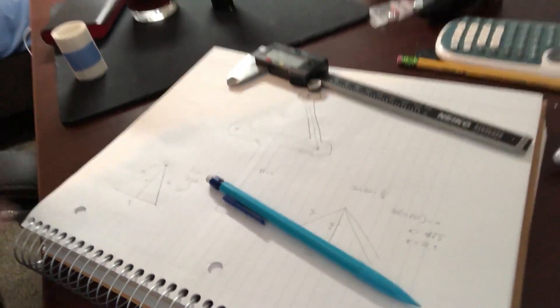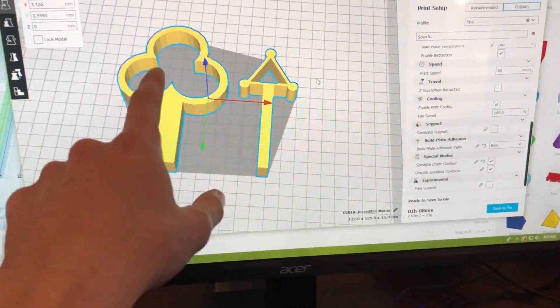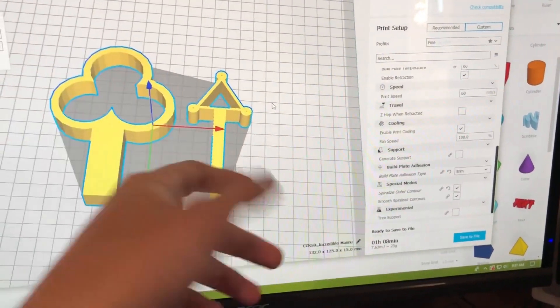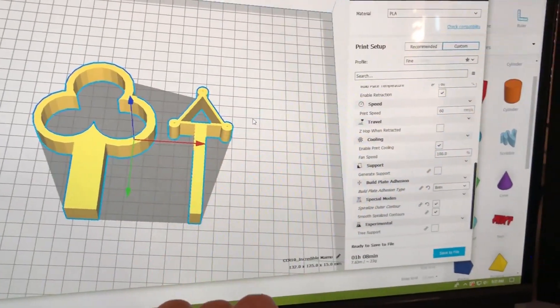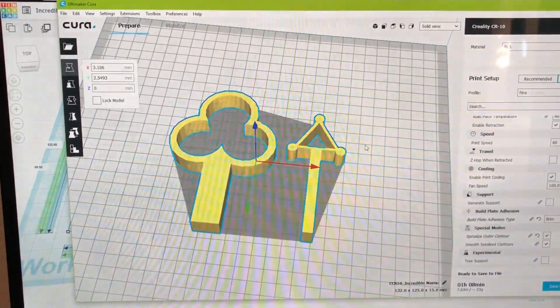I'm proud of myself for remembering my trig, and I actually checked it with paper — plotting out a 60-degree angle. The modeling is done and it's on the printer now, heating up. We have three holes that are 36 millimeters wide and then holes for the needles — the anodes — that are exactly spaced to the midpoints. I'm printing at 0.2 millimeter layer height with 20% infill. It should be done in about an hour.